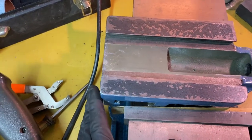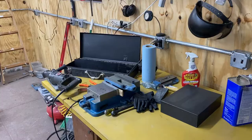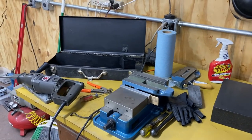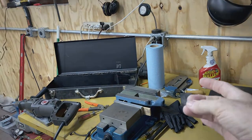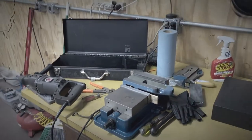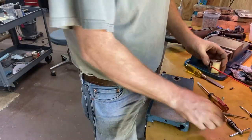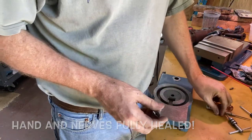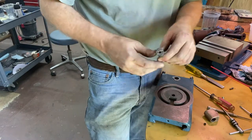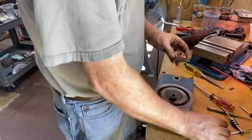I think that overall that's fairly flat — I may come back and work on it some more another day. I'm kind of at a standstill on the scraping. When I did it the other day I did it for like four hours, and right here along this side of my finger just got numb and tingly — the feeling is just coming back. I want to give that a good chance to heal. I cleaned up the nut — this is kind of cool. There's the nut that holds it in and it's got an oil access point in the middle with a set screw, so that lets oil go down. That was all clogged up in grease and gunk and I got that all cleaned out.